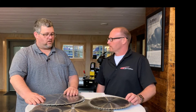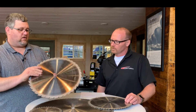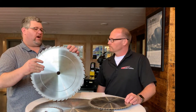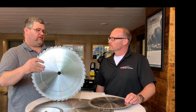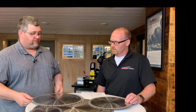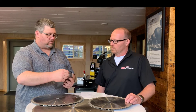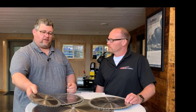How about when it comes to cutting plastic? On a radial arm saw, we use a 100-tooth blade with wider carbides on it, so it cleans away and the plastic doesn't melt to the blade. On the panel saw, I sell an 8-inch blade with 40 teeth, and this also leaves a nice clean cut — it looks like factory. Really good blades.